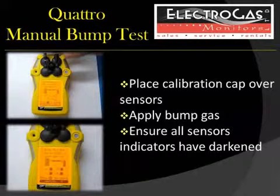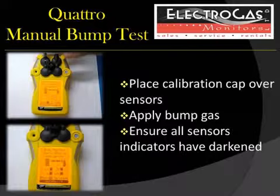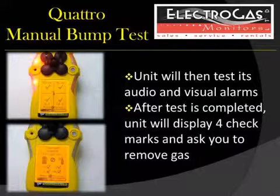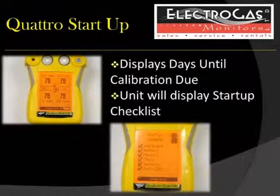To perform a manual bump test of your monitor, place the calibration cap over the sensors and apply your 4-gas mixture. Ensure that all sensor indicators have darkened. The unit will then test the audio and visual alarms and display 4 check marks if your test has passed. The monitor will display the number of days until the next calibration is due, and finally, a startup checklist.